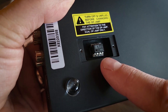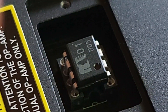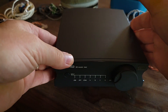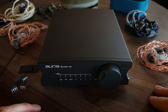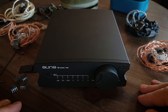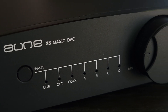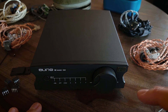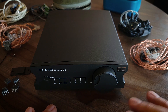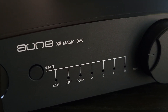On a side note — make sure when you install an op-amp that you pay attention to where the hole lines up with the notch on the side. That's partly why I didn't want to keep swapping them out repeatedly. For those of you who are tinkerers, you can also use other third-party op-amps if you want to try different sound signatures. As for filters, I also tested those — differences were very minor between them — and I ended up settling on the default filter. You can also mix different op-amp and filter combinations for even more options.